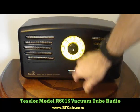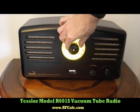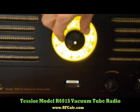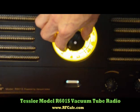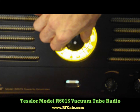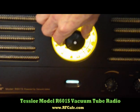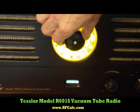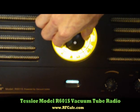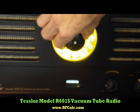If you look right down here, watch that as I tune the dial. You'll see right now that it's lit up most at the edges, which indicates that the FM balance is not very good, or doesn't exist at all. As I tune in, you'll see it close in, and that indicates that your left and right channels are actually properly centered in the tuning range.